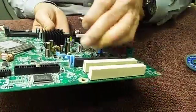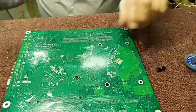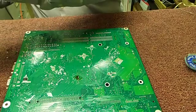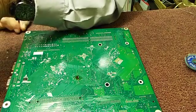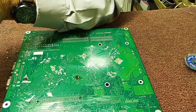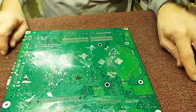Let's make sure this one is marked — the negative side is marked with a bar. We got it out! We know it's bad — don't even have to test it, but we can give it a shot just for the fun of it. I guarantee it's going to be bad. It might even be completely open because it's blown its guts right out the top. And it says... 219 microfarads at 1.9 ohms. This is an 1800 microfarad capacitor at 6.3 volts. So yeah, completely out of spec.